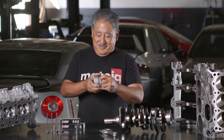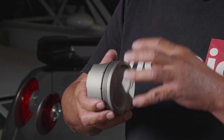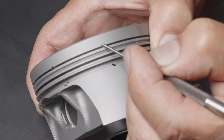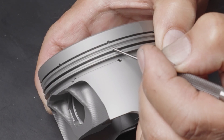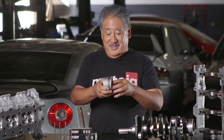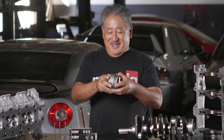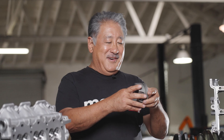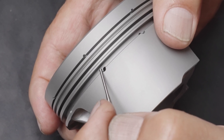You can see the really thin ring grooves for the low tension rings, and we have lateral gas porting which helps the low tension rings seal really well. We also have a pressure equalization groove in between the number one and number two compression ring, which acts like a buffer to make sure the second ring gets some pressure to help it seal, especially at high RPM. The second ring has a little channel behind it to give any oil the oil rings miss a place to go, and there's a thin rail low friction oil ring with a lot of drain-back holes.